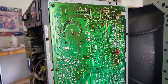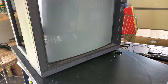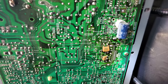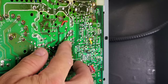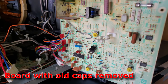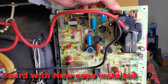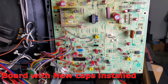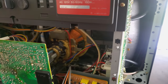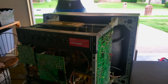This is one of my favorites to service if it's in good shape, but the problem with this one is it was in terrible shape. It was extremely dirty, and there was a lot of calcium and rust built up that had to be cleaned off. Ultimately, it caused a lot of issues where a couple of traces were rubbed off. It definitely had to be recapped — it was extremely dirty inside and had to be cleaned. But this is what it looks like afterwards. This had to be done, or we would not have gotten rid of the vertical fold over and would not have been able to get a good geometry picture.